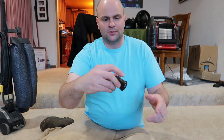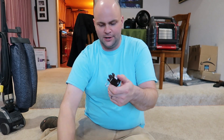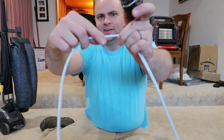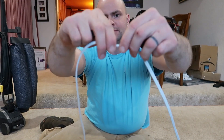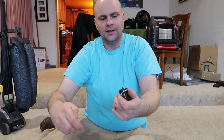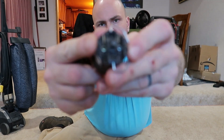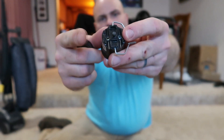Anyway, I found lamp wire — 18-gauge wire — and an in-wall connected plug. These special sockets unscrew and clamp onto the wire. The lamp wire has a ridge; you probably won't be able to see it but you can feel it. There's a bumpy side — that's your neutral side — and the smooth side is your hot wire side. Inside the socket, one connector is gold color and the other is silver. The silver is the neutral side and the gold is the hot side.